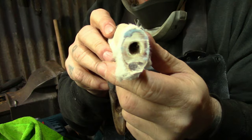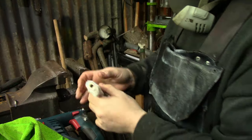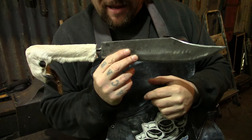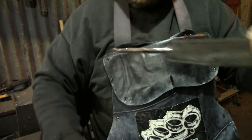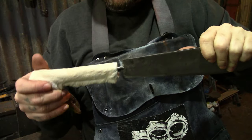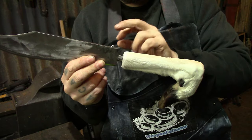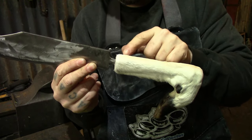I think I'm going to run a drill into this to open it up a little bit. I've now got the blade to fit in the handle — fits in quite well. It's going to be a nice bowie knife. It's not the longest tang I'd be comfortable with, but it's what fits in there. This isn't really going to be a user knife — it'll be more of a fancy decorative type thing, but I do want it to be a working knife and it will be. There's room for the guard to go on there. I now need to make the collar for the end of the handle.